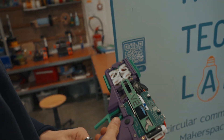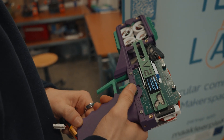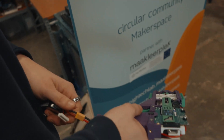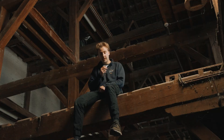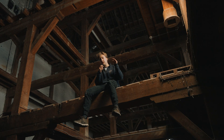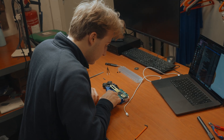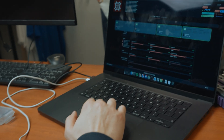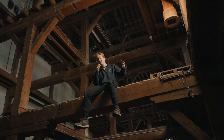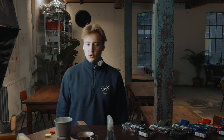Welcome to Stinger. Let's turn off the calibration. Everything electronically works — great. There are a couple more things we have to do. We have to make sure that the motor directions are correct by changing them in the ESC configurator.